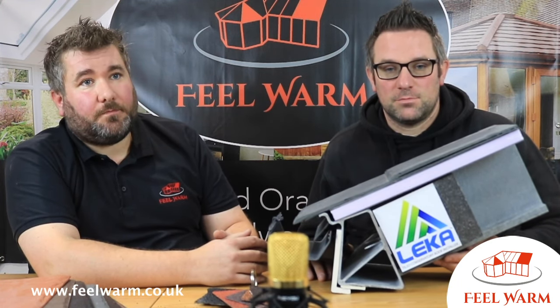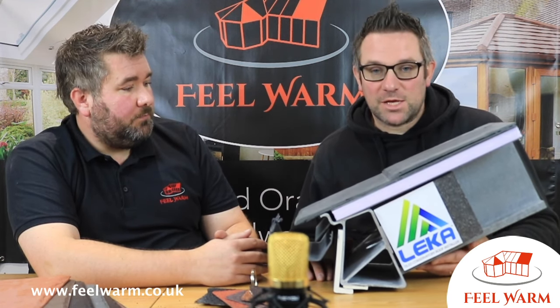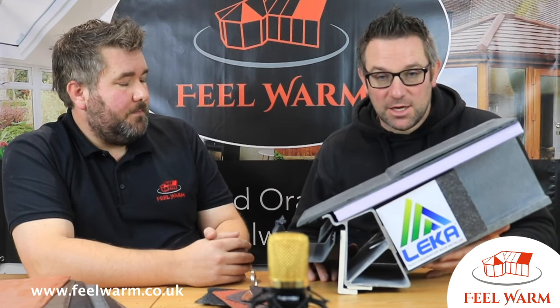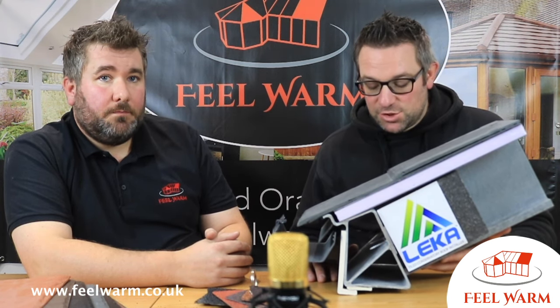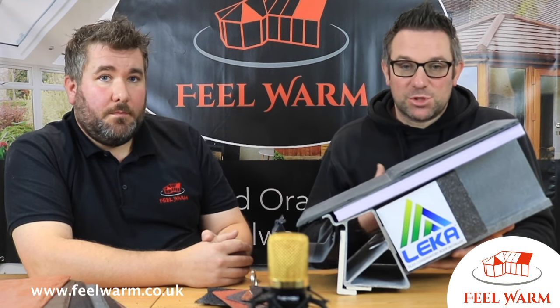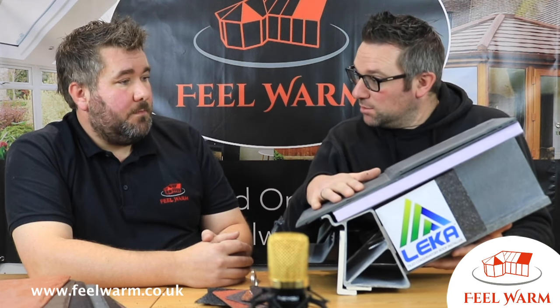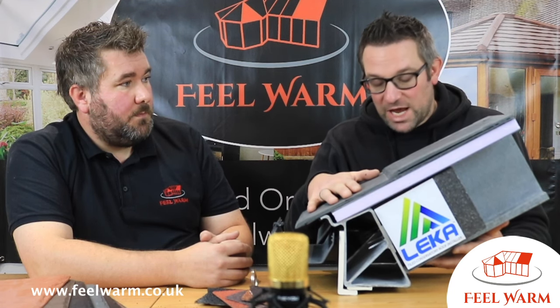Can you tell us a little bit about the construction of the Leka roof system? Okay, yeah, absolutely no problem. So as Keith mentioned before, it's made out of a material called GRP, glass reinforced plastic. It's a lot better in that it doesn't conduct cold like aluminium does, and it hasn't got the weight of timber, which can absorb water. This doesn't absorb any water, and it's strong as steel. So it's an absolutely fit material. You won't hear it from any other system, but it's an absolutely great material to use for this application.